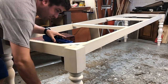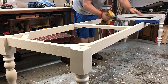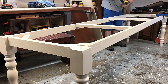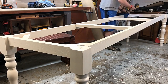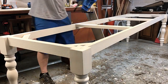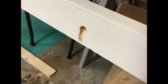A lot of people ask how I attach the tabletop to the base, and apparently I haven't shown it in previous videos. I use pocket holes drilled only on the sides so the table can move and won't be restricted by end pieces. Then I take a half-inch countersink bit and drill out where the hole is so the table can expand and contract within that pocket hole slot. I do not tighten the pocket holes all the way down — just enough to hold it sturdy. There's no issue with expansion and contraction, and it looks kind of like a skeleton key after you do that.